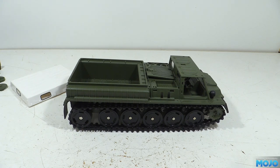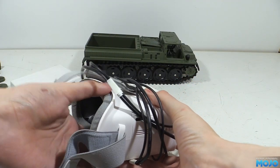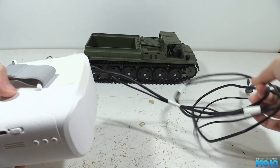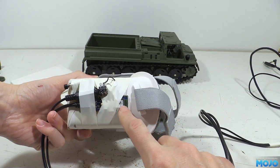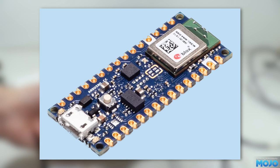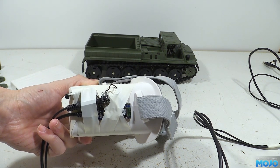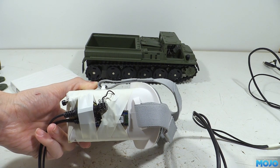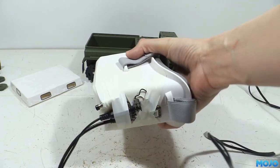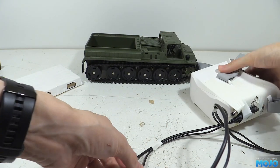Which brings us on to why I decided to add the tank to the fleet. I've been fiddling around with my FPV headsets. On the side, under the tape, we can just about make out an Arduino 33BLE — basically a little processor with Bluetooth, and more importantly a fairly good IMU, Inertial Measurement Unit. It's got a 3-axis accelerometer, gyro and magnetometer, which makes it very good at sensing movement. Add a rather nice bit of software and you've got yourself a head tracker. I'm a bit late to the party — there's a channel, Painless360, that has a very nice video covering the project in more detail, and I'll put a link to that in the description.